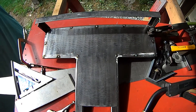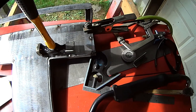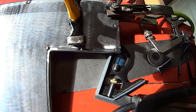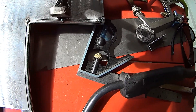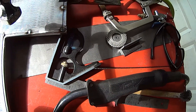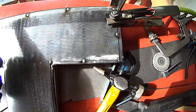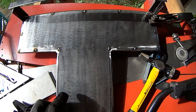The technique here: I'm holding the metal down where I'm going to weld, and I'm actually using the tip of the hammer as a place to prop my cup on my MIG gun, then shooting that gap — just blip one for two seconds off, then I have the opportunity to hit it with a hammer. I'm not going to tack this any more than I have to — it's sheet metal, it's going to hold in there, it's inside a box.